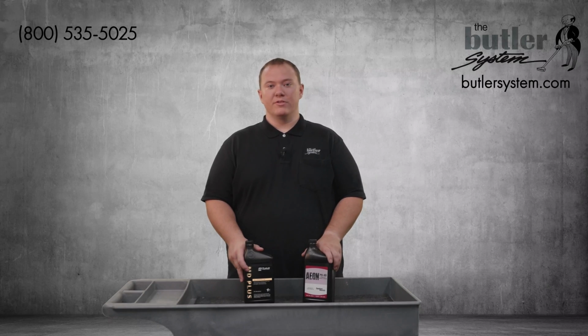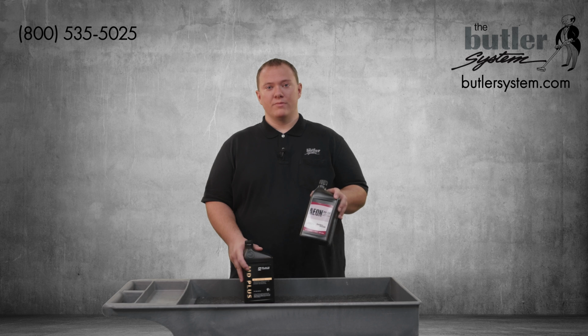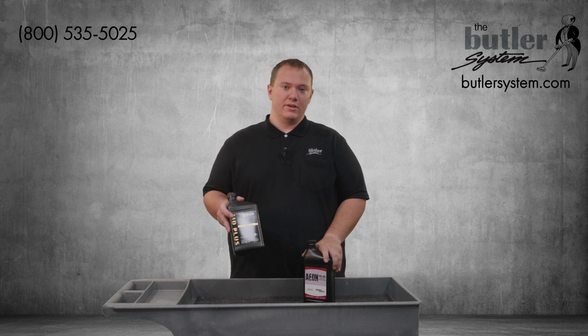After the initial filming of this video, there was a production line change that resulted in the use of a new blower manufacturer. To determine the correct oil to use in your vacuum blower, refer to the labeling on the blower, or you may look at the manufacturer name listed on the serial number plate. If you have a Gardner Denver blower, you need to use Aeon PD XD oil, and if you have a Tuthill blower, we're using Tuthill MD Plus oil.